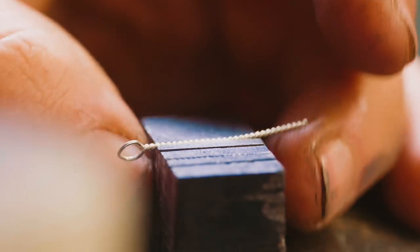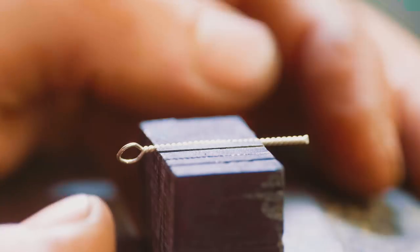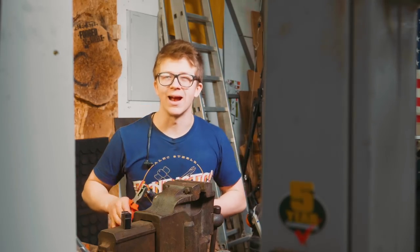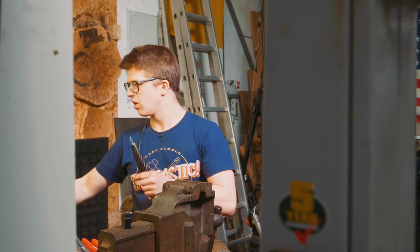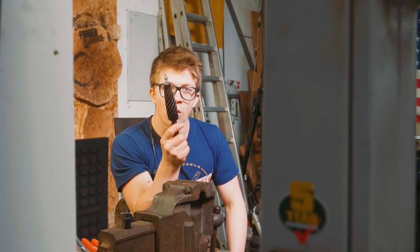Brill. I like that. I can play with it and fiddle with it, and it doesn't pop up. And it doesn't pop up, that's good enough for me. Let's mark out where it is that we got a saw. Okay, so I'm now putting the handle back. We now know that indeed our coping saw blade that has been surface ground will allow us to have a good press fit, which I'm very pleased about, because it means that we can get ready for the wire inlay.